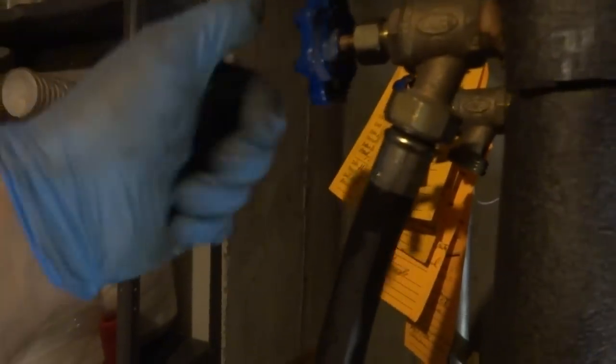Now, what is that tank about this? Is that just a water tank? Expansion. When you heat the water, it expands. You need that. If not, it'll build pressure and blow the relief valve. So if you come in and the relief valve's blown, most likely that tank is an issue. Oh, okay. Yeah, we're getting a flow now. We could hear it. Before, we weren't getting that.